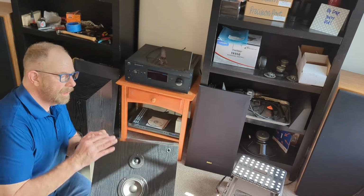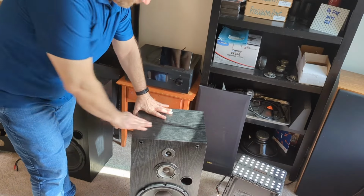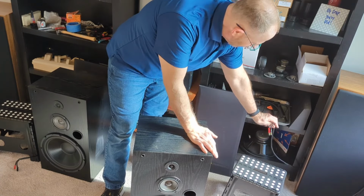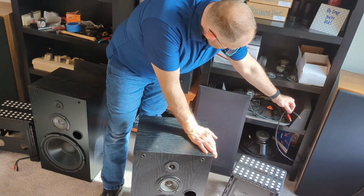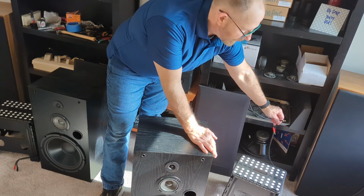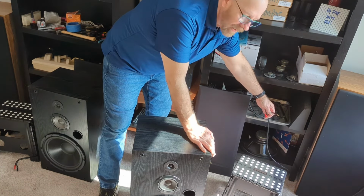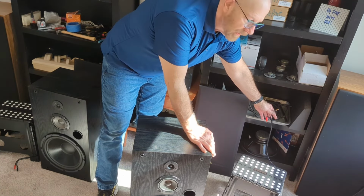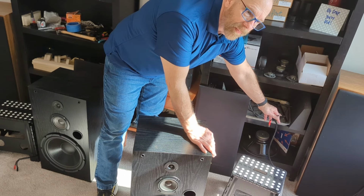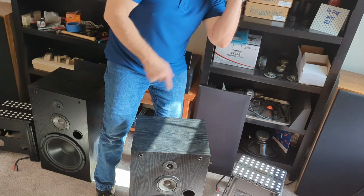Set for testing. In case some of you are wondering too, maybe you've seen me disconnecting and reconnecting this wiring coming from my receiver. This is just in-wall cable, but it's 12 gauge pure copper, so it's pretty decent cable. The connectors are banana plug crimp-on connectors from Parts Express, and I've also got them soldered, so it's crimped and soldered banana connectors. Those work really nice.